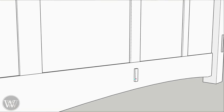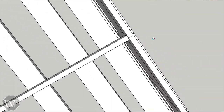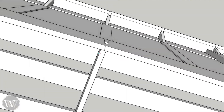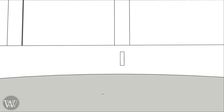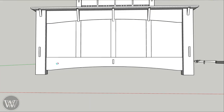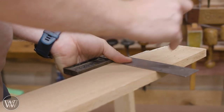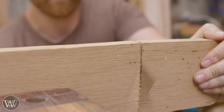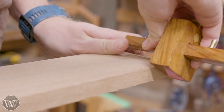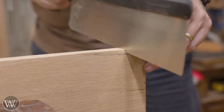Next we're going to be creating a mortise and tenon that goes in the middle of the main stretcher. You can see there's another beam that goes end to end on the bed — this will help support the main mattress supports on top. It goes through a tenon that's a bit oddly shaped because it's not actually in the middle of the board; it just needs to look like it's in the middle because the only thing you see on the outside is the tenon coming through. The rest of the board is completely invisible underneath the bed, so you can use an ugly board for this one. The only thing that's really important is having a strong board end to end and a good strong tenon.